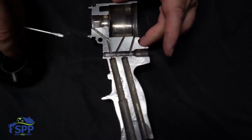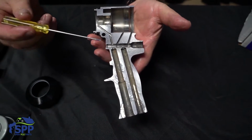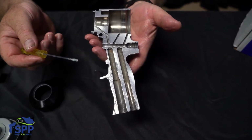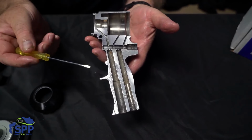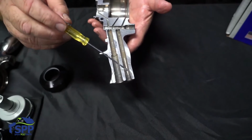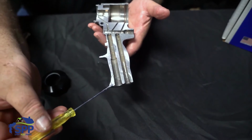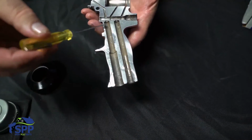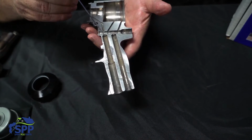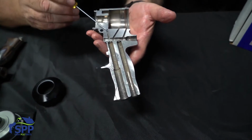The very last thing, once you've disassembled your gun and you're down to this point where your handle is bare, because you make sure that you don't have your trigger spool in, you want to purchase a 1/8 inch by 6 inch long drill bit. And you'll come in from the bottom. Usually you'll either have a plug and a muffler. This doesn't have either, obviously it's been removed, but anyway, you want to take your 1/8 inch drill bit and come up through here, and as you can see, it will go through the trigger spool where it rides and come up here. This is actually a newer housing, as you can see right here.